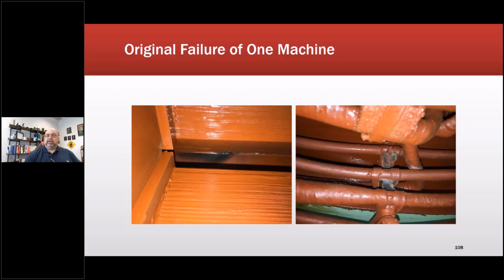So they had a couple of issues on one of the machines. One of them, they had spent 6 weeks, everybody pointing fingers. They didn't want to pull this motor, and nobody would tell them what they were seeing. And I got a call to go in. It was my first trip out there, and I discovered that it was, in fact, an insulation to ground issue on the rotor. A simple Megger test identified it, and I said, well, rotor's bad, motor has to come out.